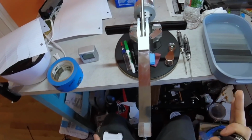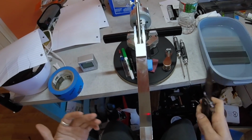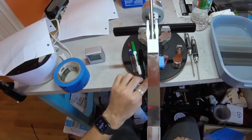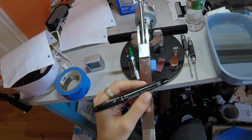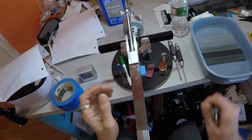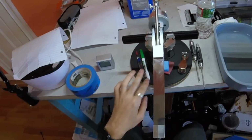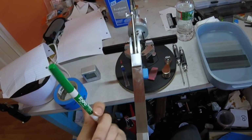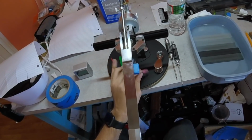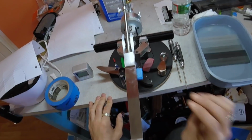So things you will need, or are at least recommended, are going to be included in this. A knife that needs sharpening, obviously. Your sharpener. Sharpie. Go with a color. This was a tip given to me recently, I think by David. Use a color because when you're taking metal shavings off, they can appear black, and so it's easier. This is something I don't hear anybody else really say, but if you have a dry erase marker, it can help you find your angle for stropping. A big rubber pencil eraser is good for cleaning stones as you go, for taking the metal shavings off.